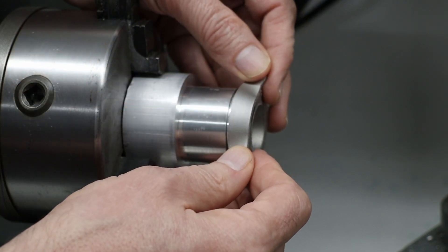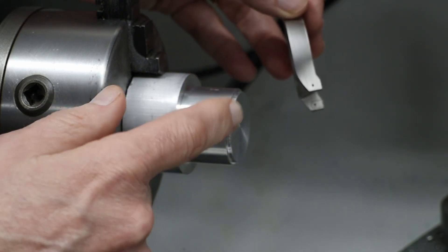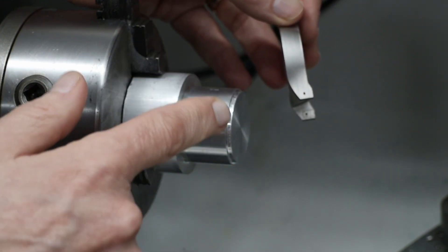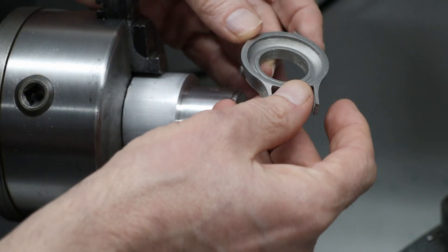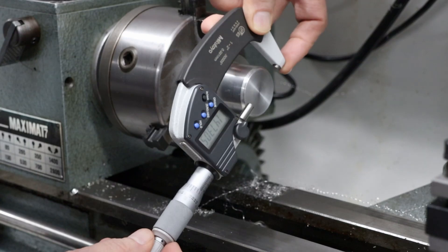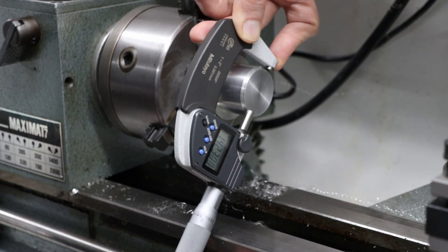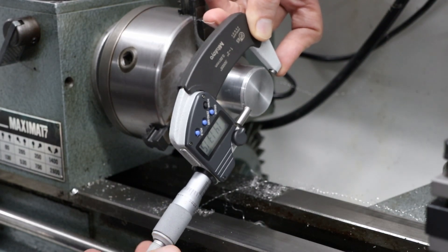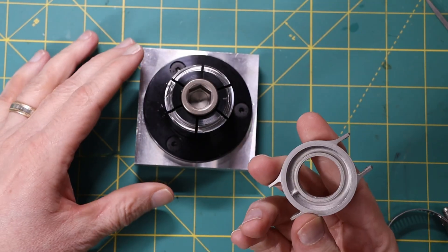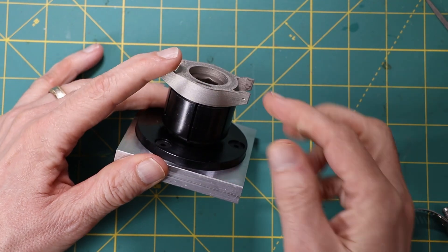One watch body falls outside that range, ever so slightly. So the idea I have is to have two sets of clamps — not ideal, but one inside diameter clamp for the main range and another for ones that are slightly smaller. I measured the resulting diameter with a micrometer and, based on the clamping range of the inside diameter clamp, chose the inside diameter for the low end of the range. Then I had another idea — here it is fitting on the clamp that I've remachined, which you'll see in the rest of this video.